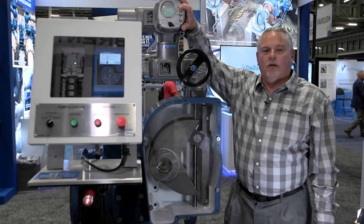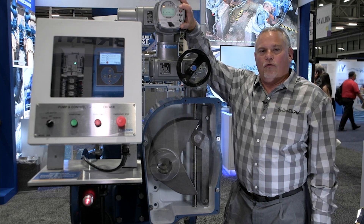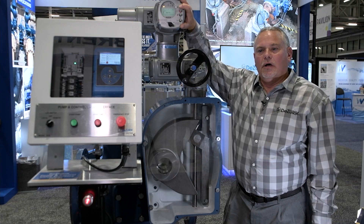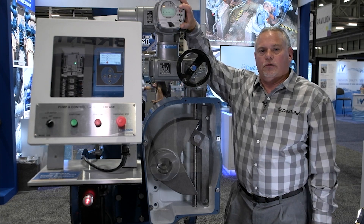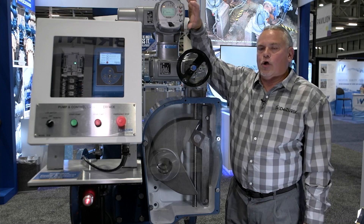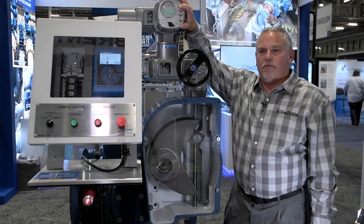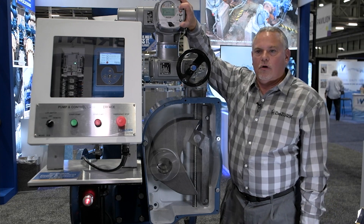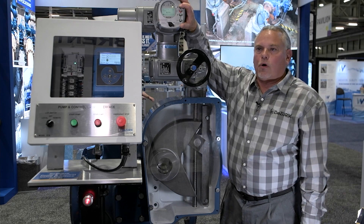The CPC SmartCheck was developed from the voice of our customer, who was looking for a pump control valve that didn't require any maintenance. Typical cylinders, air actuated solenoids, and water fitted cylinders require maintenance. So we incorporated this motor actuator on top of a unique torque unit that will provide surge-free operation for opening and closing, and the motor actuator does not require maintenance.